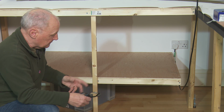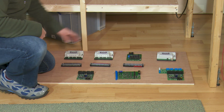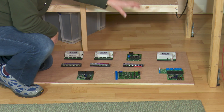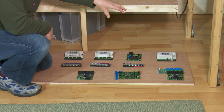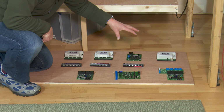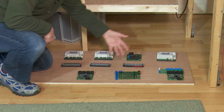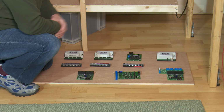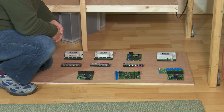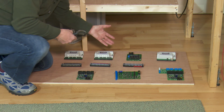So what are my alternatives? Well, there's this board just here, and it's just another scrap piece of 12mm plywood, but just pacing out the items at the far end, we've got something known as a PR3, which is an item which speaks to a computer. It has a USB input. Then we have the PM42, which is the power supply, which breaks up the power supply into 4 different areas that go out into the layout. So that's 4 different districts that go out, and each of these relays has a safety side to it, in as much as if you get a short on one of these districts, the other 3 remain powered, so your whole layout doesn't die.